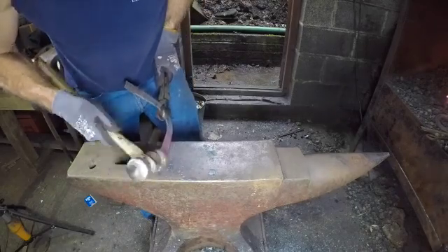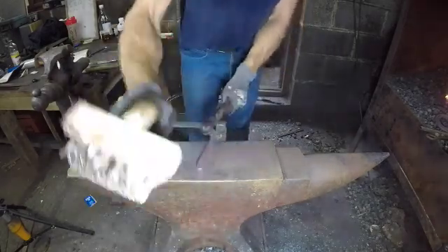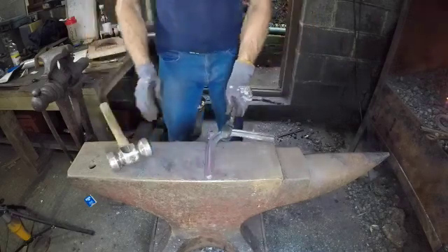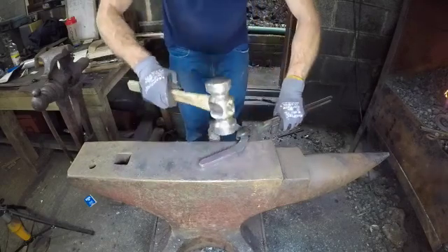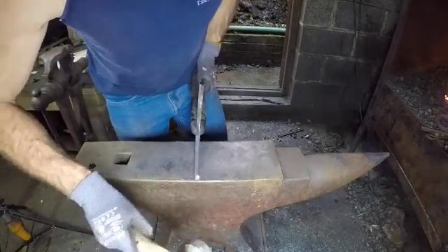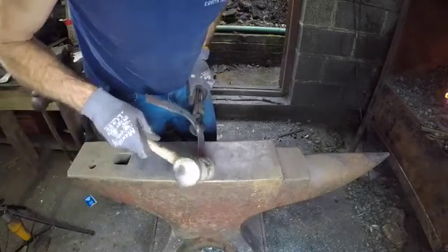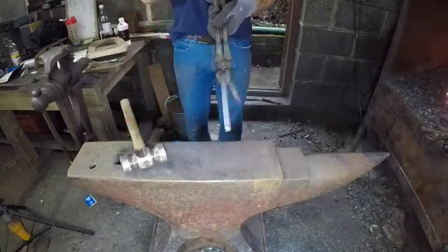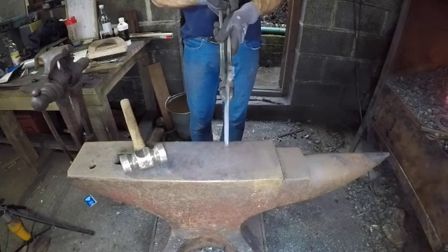Once the heel is finished, make sure the branch remains nice and straight. Any kinks here when you come to turn it end up making the shoe a lot less even and you lack the finesse. You can see the branch is nice and straight there — just do light levelling. We don't want to squash the concave section, and any backing up to get rid of sharp edges you can do by keeping your tongs in line and bringing your hammer directly into the back of the shoe. The finished article is about two thirds on the inside section and one third on the outside section.